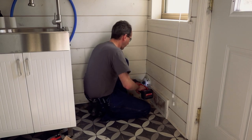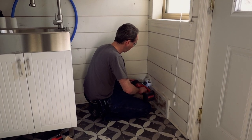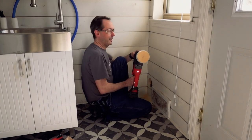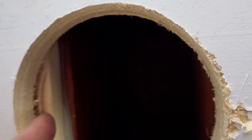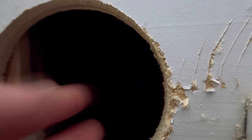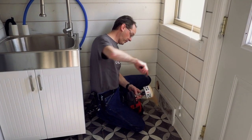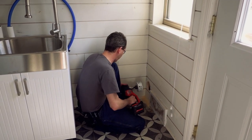That's instantly way more better! The downside is there's a wicked sharp bit of metal trying to slice my wrist. It makes it quick and easy — I love this tool. Bad news though: we're edging into a stud cavity. There's a stud right here. I could bore all the way through it but that would suck, so now we have to move the hole over a hair. We're gonna embiggen the hole to the side just a little bit.